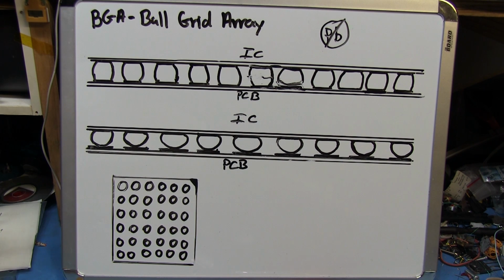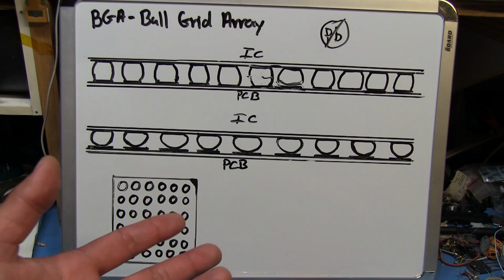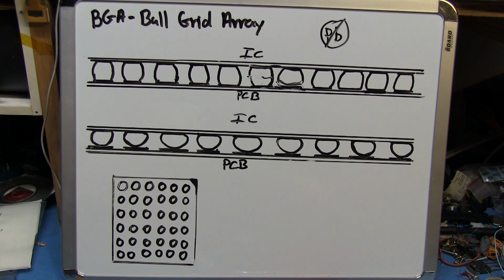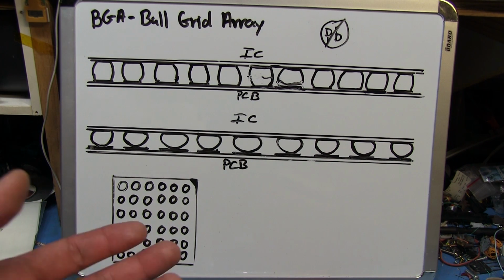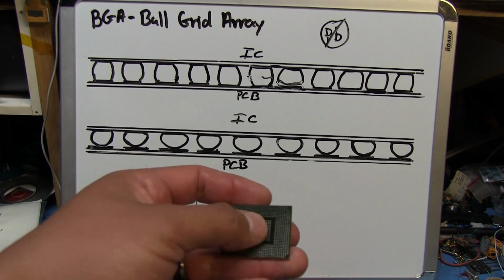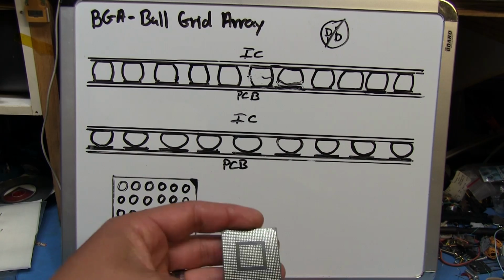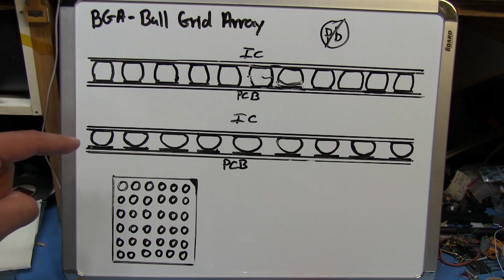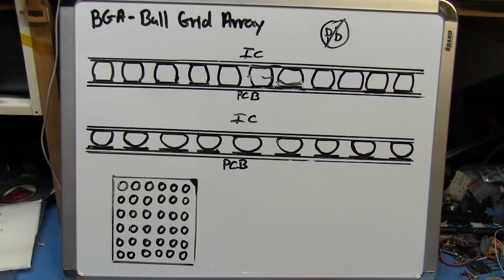So we're just going to clean everything off and start from scratch. Once I remove the GPU from the board, I'm going to flip it over, reapply some leaded solder balls, and flow them onto the pads on the GPU, so that they're seated on each pad, properly bonded, and making contact. Then I'm going to place the GPU back onto the motherboard, and I'm going to try to make sure that I get pretty good alignment in its designated area.